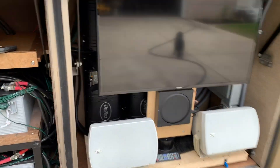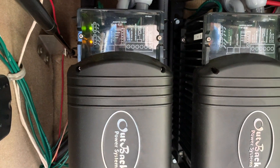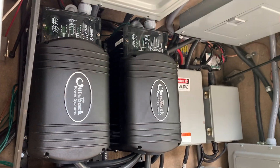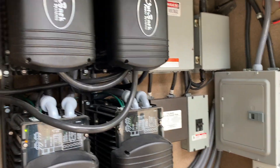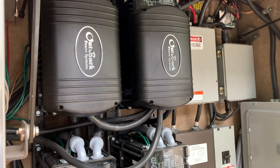These inverters back here — they work, but they're not working right. The problem is these inverters are only 30 amps each and I've got a 50 amp service, so I have to have two in parallel. Then I've got to have two in series because I've got two legs — two panels.